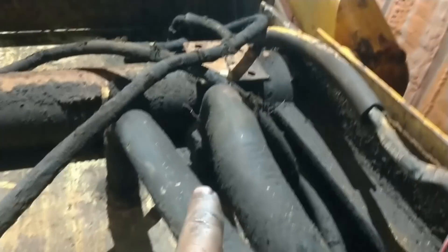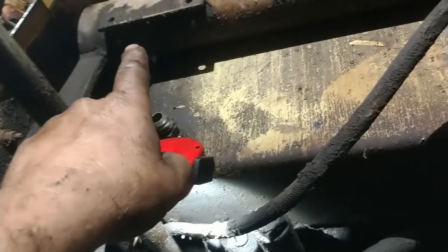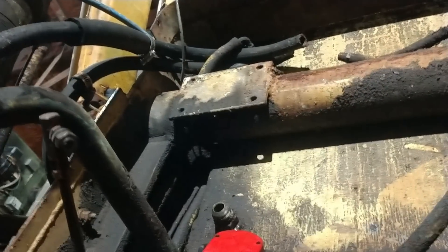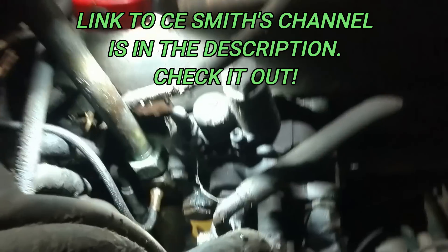The suction line goes up, turns into pressure, and comes back on this steel line into this valve block, then out of the valve to the rear valve controls, and returns right here. There is a hydraulic filter which we'll probably be relocating and using a different type instead of an insert, and it comes right back up into here. This was part of the cooler — this line was a return after it came from the cooler. It looks like they're pulling fluid out of the reservoir, running it through the power steering pump, then bringing it to that block and splitting it off — sending half to the cooler and half to the power steering.